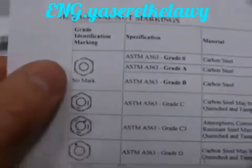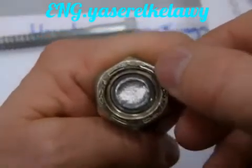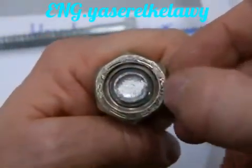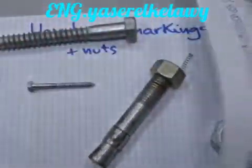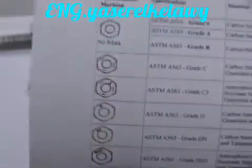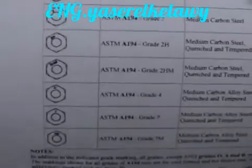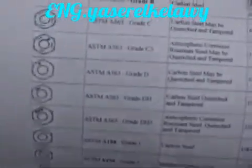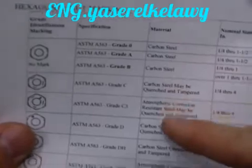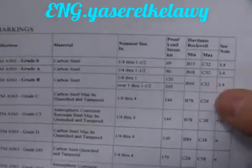You can see unmarked nuts and you can see some special marks. There are some lines around this nut for this anchor bolt, and those lines correspond to one of these nut standards. You can see the ASTM standard number there. This is how nuts are marked — materials are chosen, along with their proof load and their hardness.